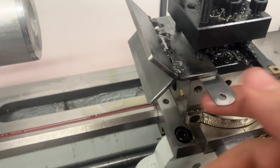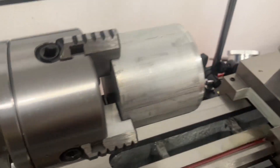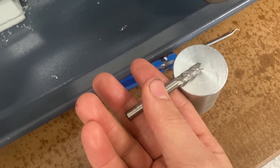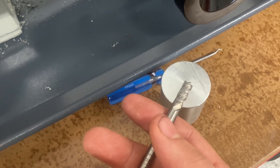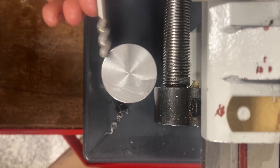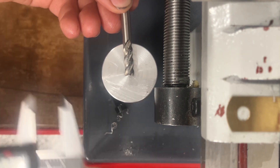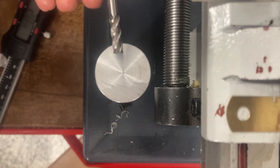The way you get the height set up perfectly is once your work piece is clamped in the fixture, you run it up against the end mill. Your end mill will look like this and you can take a measurement from this side and from this side, and shim it until that's perfect — and once that's perfect, you know you're centered. Then you can do multiple end mill passes, moving the slide in and out and slowly going deeper. That works out pretty well.